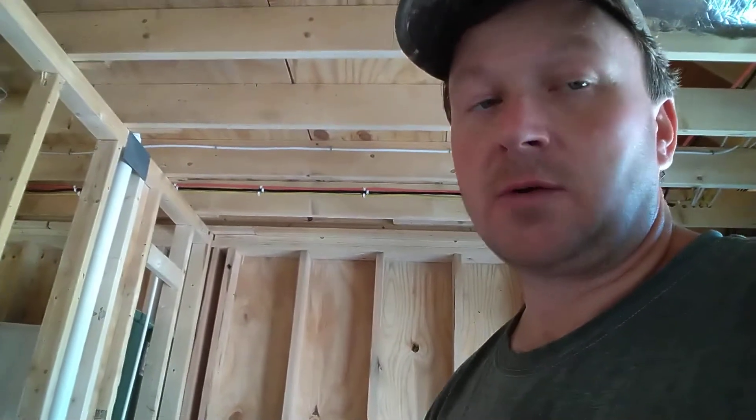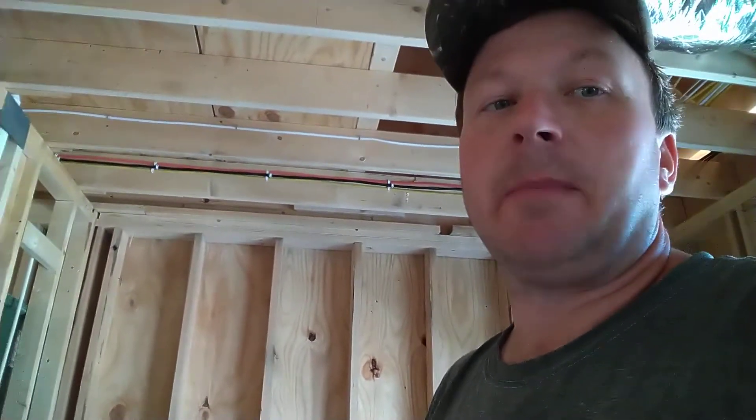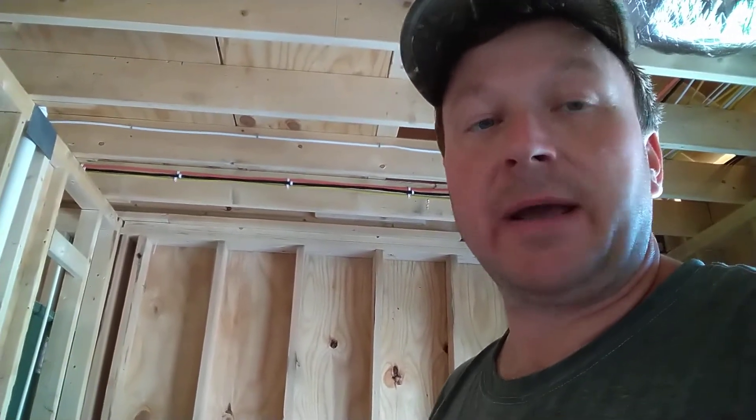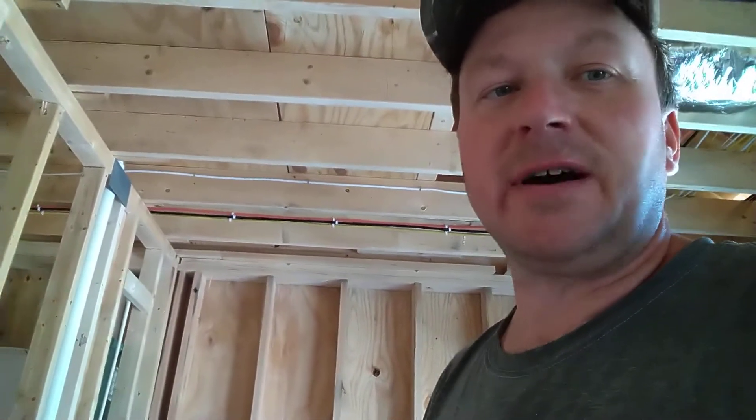I'm changing my layout to reduce my crawl pulls, so now my pulls are going to be up and overhead. On the first layout I did, going through real fast trying to get the boxes nailed on within about a three-hour span — it's practical, but sometimes you'll find yourself putting a box in a location such as underneath this window right here, where you have to do an underneath pull.